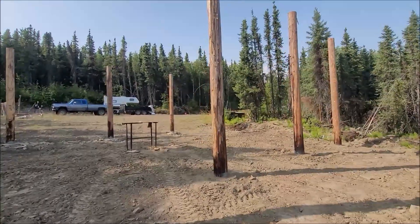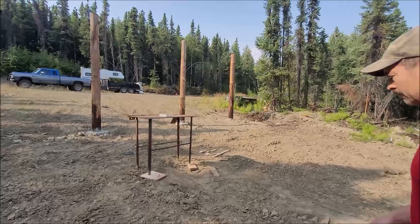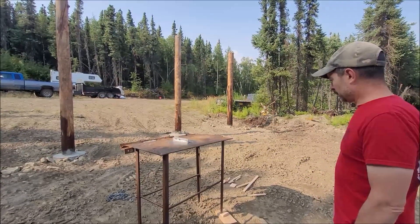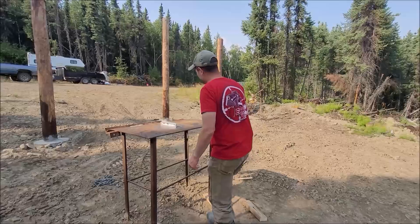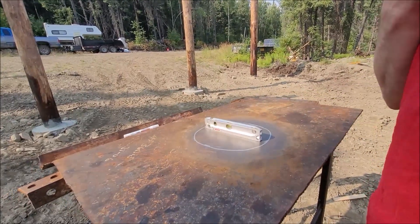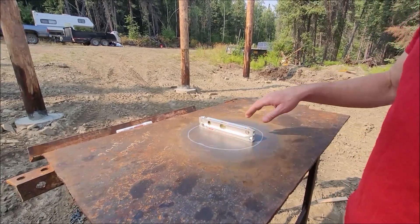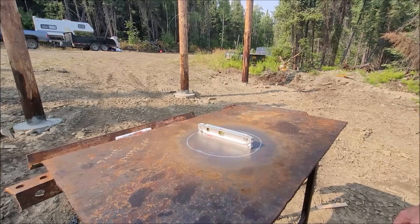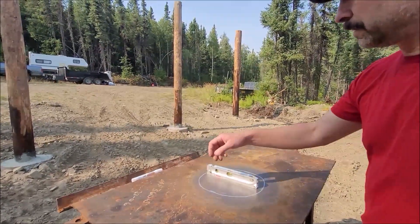To do that I pulled an old welding table up here in the center, and I got a laser level. I got the welding table leveled up, roughly in the center of the building. This is kind of my OCD, but there were some welding spalls and slag on the table, so I cleaned up a circle and made sure there's no welding spalls — hit it with sandpaper — so I can keep my laser inside this circle. That way I don't have to worry about the level sitting on a welding spall and giving me an incorrect reading.